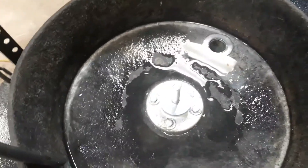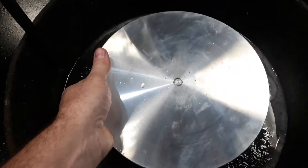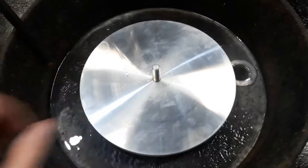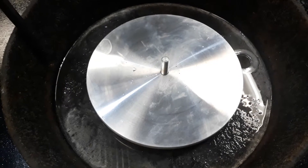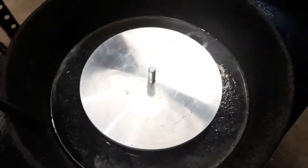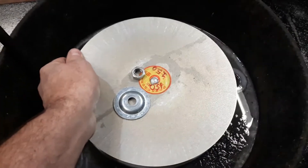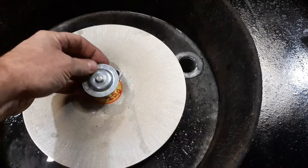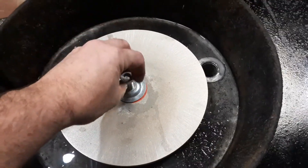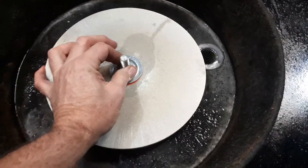The second purchase was a half inch aluminum master lap. I did have aluminum at the house and thought about turning one on the lathe, but I figured I'd spend a half a day turning that out and truing it up. I just bought it for 50 bucks off eBay — done deal. Didn't have to worry about it. Saved me a lot of heartache, time, and money. The diamond disc I did purchase as well — I don't remember what I gave for it, bought it a while back. I got some other grits, but for right now I've just got a 150 in there. I used the conical washer for the top to hold it on with the bolt.